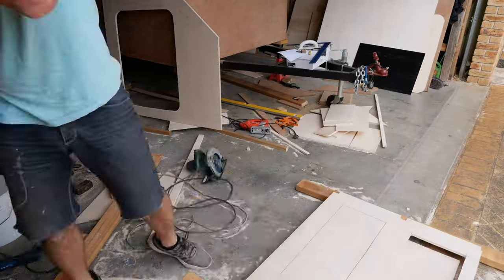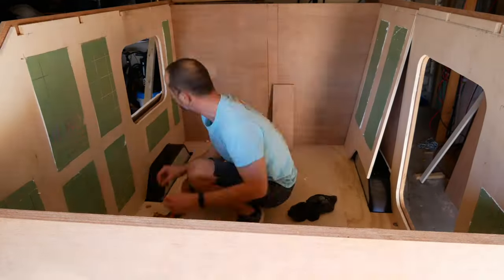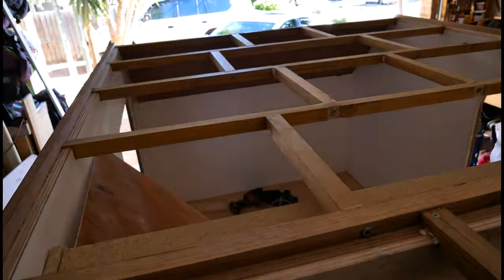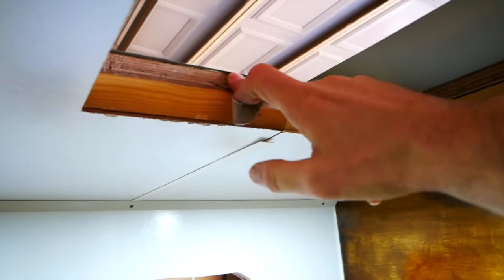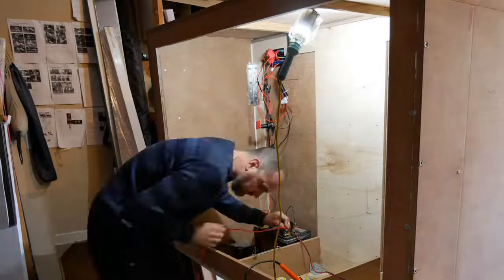The structure of the walls consists of 18mm marine plywood followed by 15mm interior ply with insulation cutouts, and finally 3mm interior melamine panels. After completing the exterior walls I started adding another layer of plywood on the inside — a soft, lightweight interior plywood with placeholders for insulation. I used foil board for insulating the trailer: one layer of 15mm foil board in the walls. For the roof and ceiling I went with a more sturdy structure using 30x30mm hardwood studs on which I placed 18mm exterior marine plywood, achieving a strong roof I can easily walk on. Before installing the final roof plywood layer I transferred all the cables and electrical wiring connecting the rear of the trailer with the ceiling.